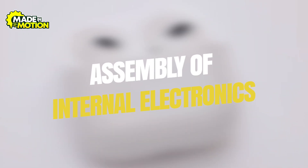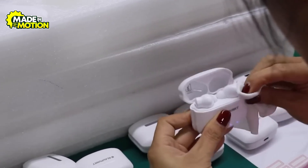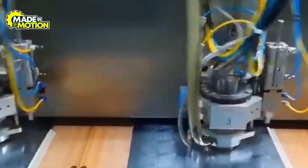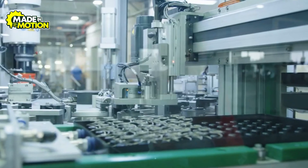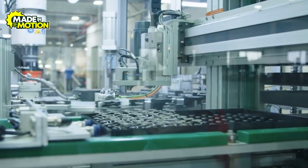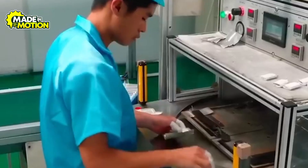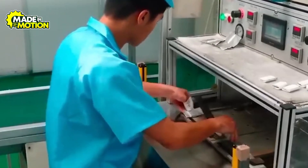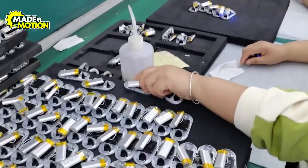Step 6: Assembly of internal electronics. With every component ready, it's time to fit them all together in a space barely larger than a grape. Assembly starts by placing the tiny chips, microphones, and sensors onto the printed circuit board using high-speed pick-and-place machines, which can position parts with hair-thin accuracy in a fraction of a second. A thin layer of solder paste holds each component in place, and the entire board passes through a reflow oven where controlled heat melts the solder and creates secure electrical bonds. Any through-hole components, like certain connectors or wires, are hand-soldered or machine-inserted afterward.